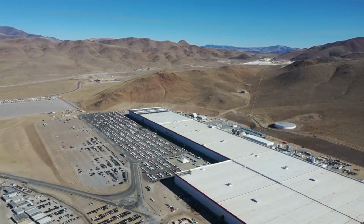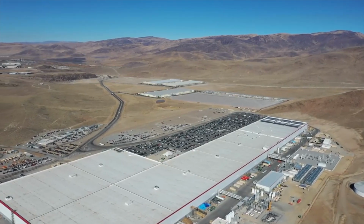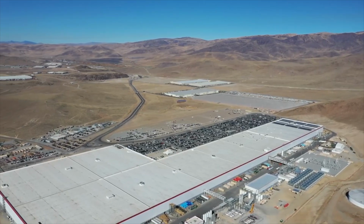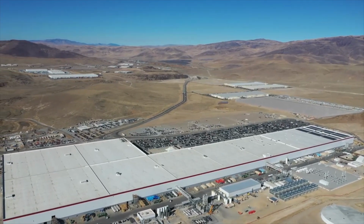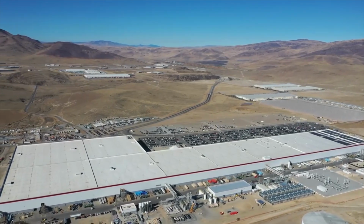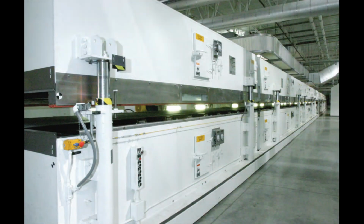Tesla's vertical integration is part of what makes them unassailable by normal automobile manufacturers. They are going to slow the expansion of the factory because right now they don't need the space. It has nothing to do with car sales. It has to do with what we discussed earlier, the acquisition of Maxwell Technologies. Recall I discussed these huge, long, complicated, expensive, noxious drying ovens that they have to run their foils through to dry the electrode material on them. This is a nightmare. Maxwell has a dry coating electrode process that eliminates that and allows hundreds of feet of battery cell production line to simply disappear.